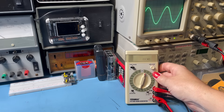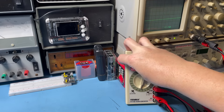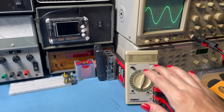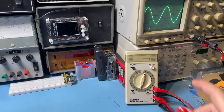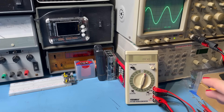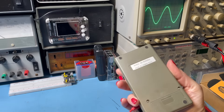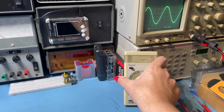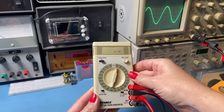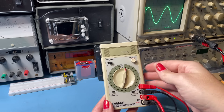There you go - you can make a tune out of that. That's quite handy - you could put that signal into an amplifier for testing purposes. It's just a handy little portable device. I like these little battery powered portable devices. It's a bit old, it's a bit retro, but it still does the job. The frequency range on this is 20 hertz to 150 kilohertz, and you've got 46 steps. On the times one range it goes from 20 hertz to 1.5 kilohertz, and on the hundred times range it goes from two kilohertz to 150 kilohertz. The specs claim accuracy is plus or minus 3% or less. This is made by Tenma, although this particular unit is made in Taiwan, but Tenma is actually based in Ohio.